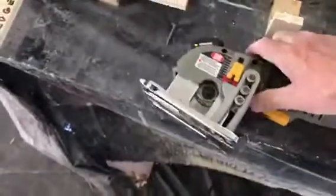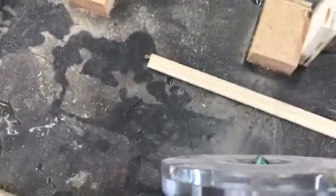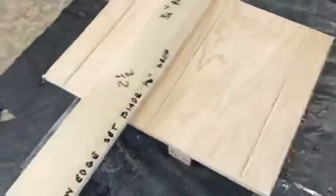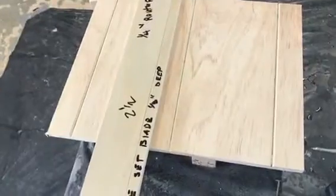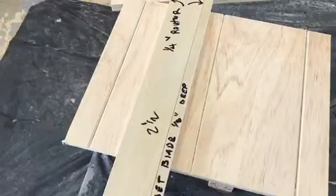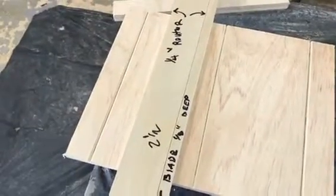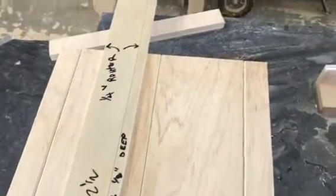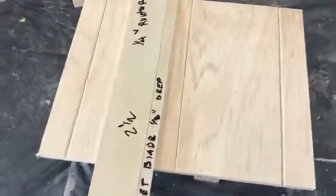And then the second tool I have is a small 1/4-inch router, and it has a little V-groove bit, which I just set so it plunges down the center of the groove you're going to cut. So the first thing we're going to do is use a template. I made a template that's sized to these tools here, and I'm doing my pattern on a 6-inch pattern. So I'd make my mark for my first cut, and then I go 12 inches over for my next one, because you're going to move this down every time using the square, line it up.